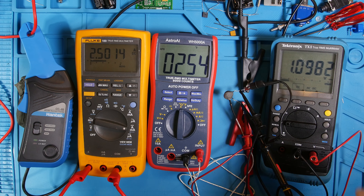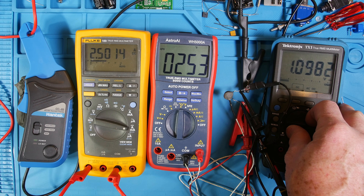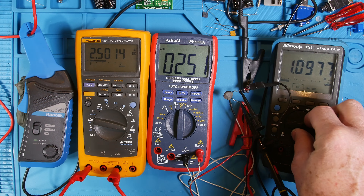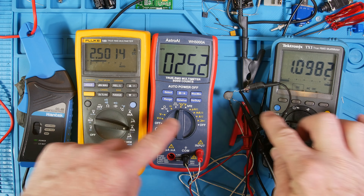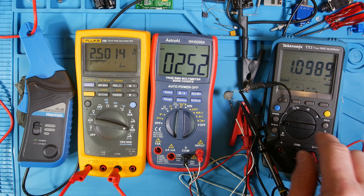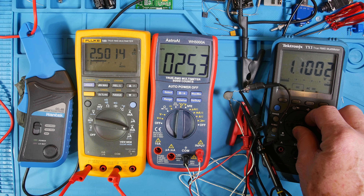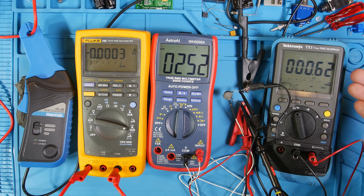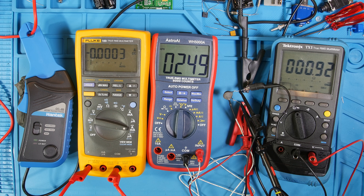Okay, I'm going to turn the power supply off and quickly change this to ohms. It won't change super fast so I don't have to rush — you can see it's leveled off. That thing's pretty hot — it's going to stay hot. You'll see how quickly it cools. Let me turn off the current and switch to ohms. It's down to 0.34 ohms and it's already starting to increase. So, 0.34 ohms. We start off around 12 ohms and drop down to 0.34 ohms — that is what this guy will do for us.